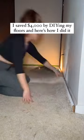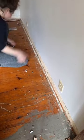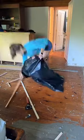First I needed to remove the baseboards, so I scored the caulking on the top of them and used my pry bar to pull them off. Then we removed all of the carpet in the room, and I removed the tracks and the staples that were holding the carpeting in place, and then I had to clean up all of that mess from the demo.